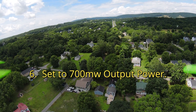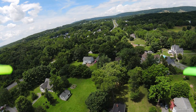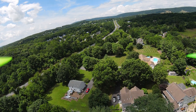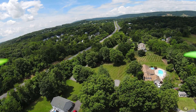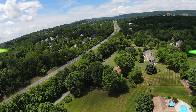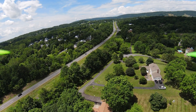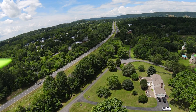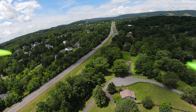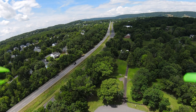Number six: 700 milliwatts. If you're flying in the United States, the maximum power from the goggles to the aircraft is 700 milliwatts. By default I think you may be at 25 milliwatts. And here we are at three minutes — I'm hitting the turnaround point because I've lost signal. So I've got some success here: this is one mile out. I've actually doubled the distance using patch antennas, changing nothing else from the last video. Everything is out of the box except now I've got these patch antennas versus the omnidirectional ones that come stock. Patch antennas gave me a mile.